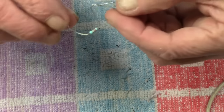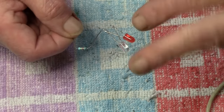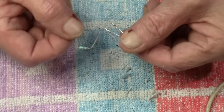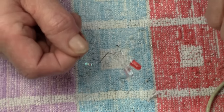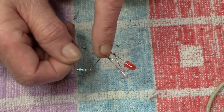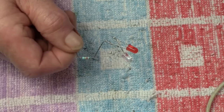Right, here we go. You may remember this circuit here, which is the two LEDs opposite to each other. Remember, one's soldered backwards to the other one. You've got the ballast resistor, and this is the one where it reverses with the controller for front and back lighting, for forward and rear motion. Yes, that does work fine, but I didn't put the reverse bias diodes across this, so you will possibly need to do that just to help protect the LEDs.